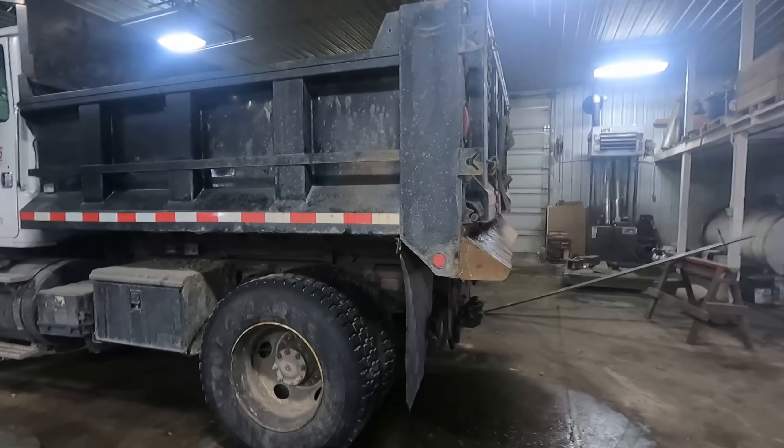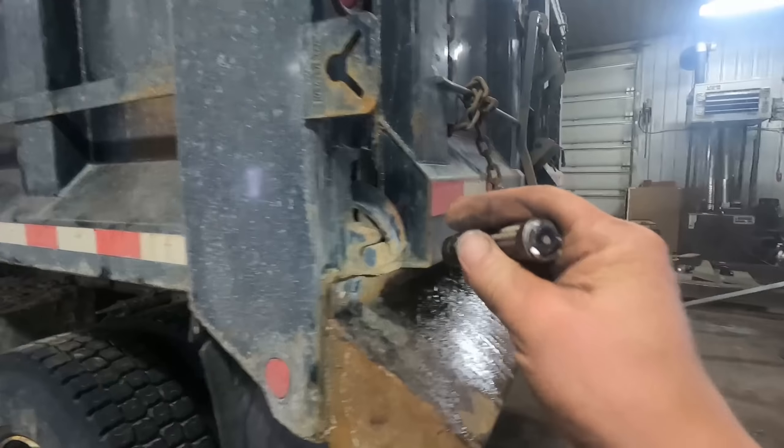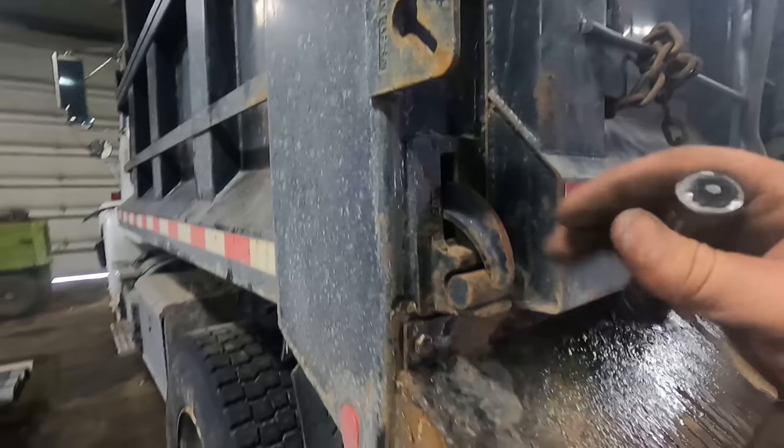All right, Kerr has this pin fixed on this pneumatic lock. You can see the bolt that he's got in there now - he had to cut the pin out. That is the tie rod end or the clevis end of the actual pneumatic cylinder right there, and that does the cam-over lock design for these pneumatic locks. He ended up drilling a hole through the bolt so that we can keep it greased, because we're having trouble with these locks getting stiff and not working on the tailgate.